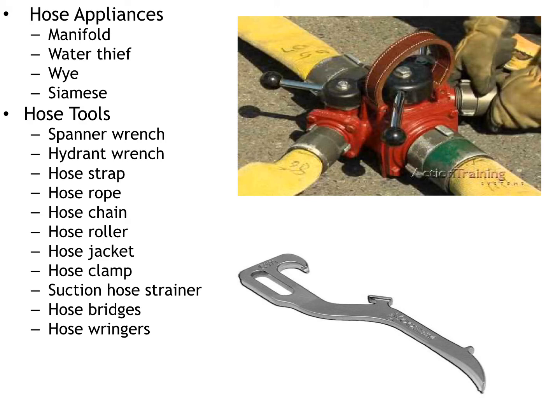On a side note, you really don't want to use hose clamps. I'm not going to go into the full detail of hose clamps. They are efficient. The problem with the hose clamp is when you need to physically take it off the hose, but the hose is charged off the hydrant. It's basically a loaded bomb, and it's just waiting for you to accidentally trigger the releasing mechanism, and the hose clamp's going to go flying.